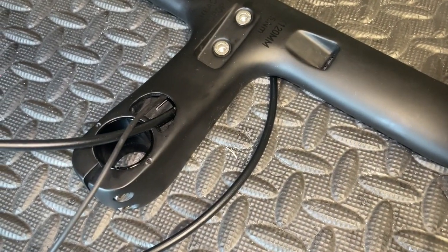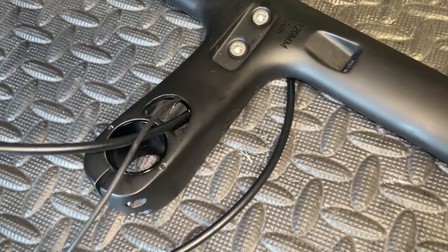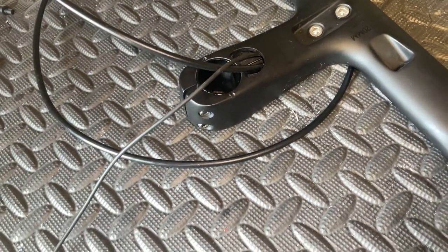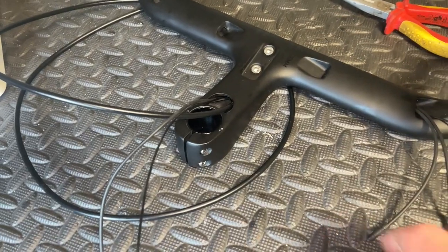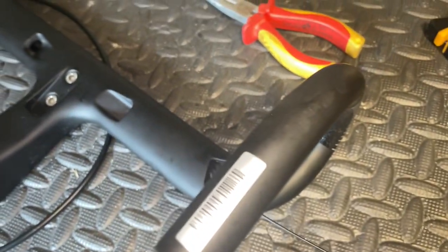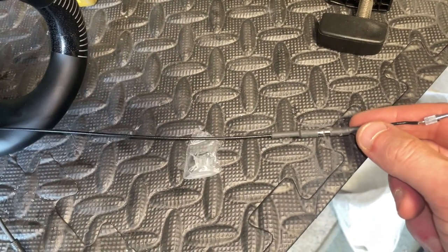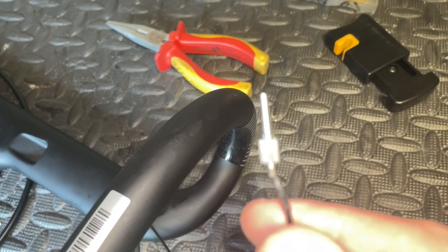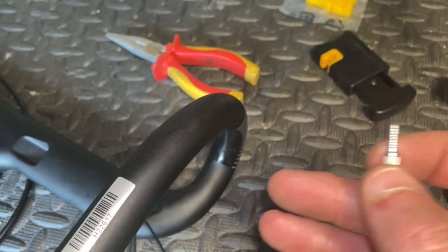So two DOT wires here. I've put my threader through and there it is — you can see it moving backwards and forwards in the hull. So I'm just going to get some long nose pliers and fish it out. We'll pull that through. We've got a magnet on the end that's going to fit here and a little screw thread which screws into the hydraulic hose, and then we just pull it through.